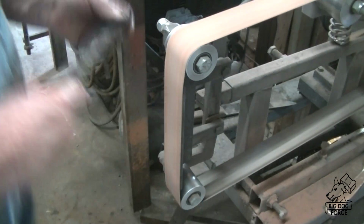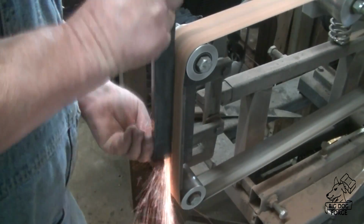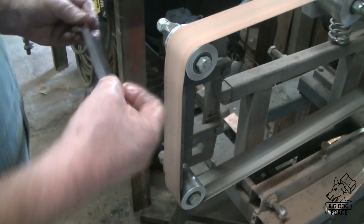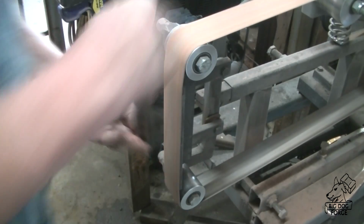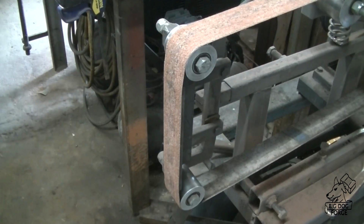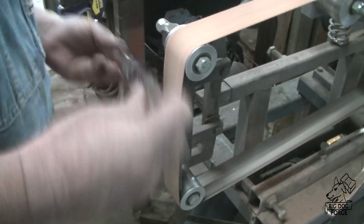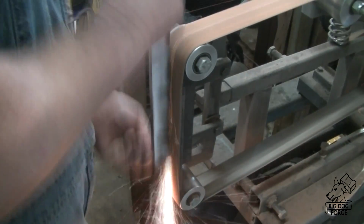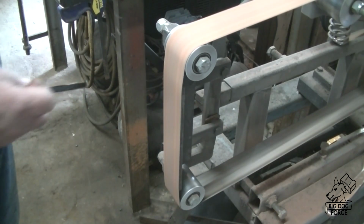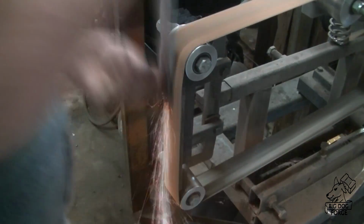And you can see the cut marks there a little bit from the surfacing tool. But I'm also noticing some cracks showing up. So I didn't film it here, but I take it away and off over to the vise, and I grind out as many cracks as I can see at this point. So it ends up looking a little lumpy in a couple of places, and you'll see that here in a second. I'll bring it back and finish dressing it up right here. And you can see some of those areas that I ground away. There were quite a few cracks in this thing, and at this point I'm thinking that I may not be able to get rid of all the cracks in it.